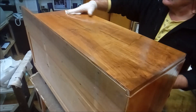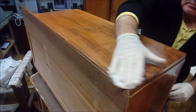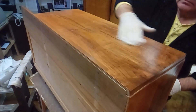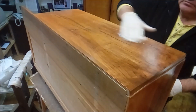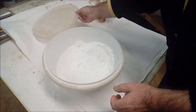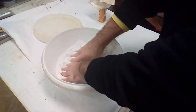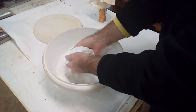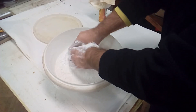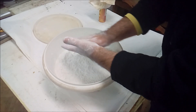After one day of drying, the surface is coated with a prepared cloth soaked in acid. We notice that it becomes very cloudy. This is normal and is due to the reaction of the oil with acid. Immediately afterwards, the palms of our hands are dusted with lime, and the surface is cleaned to neutralize all the acid.